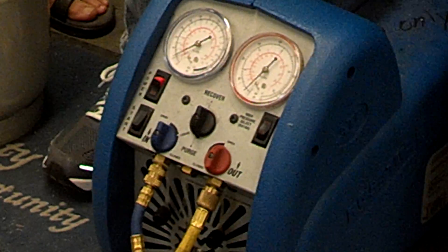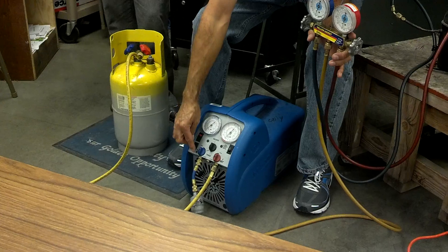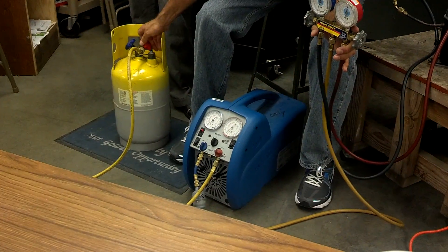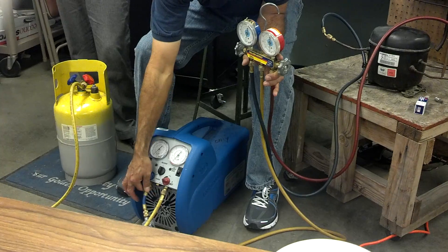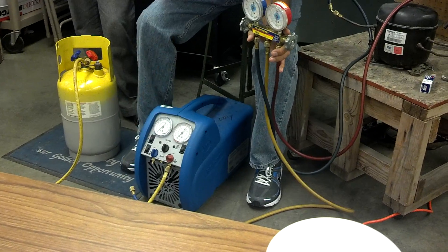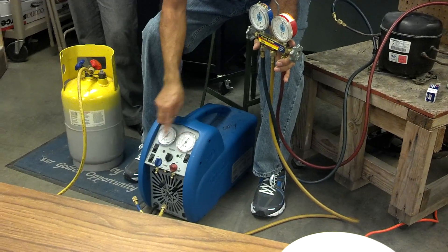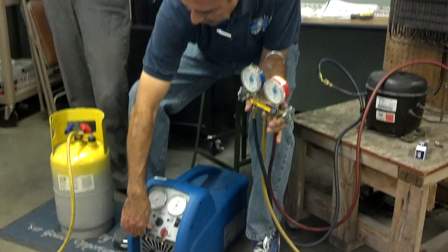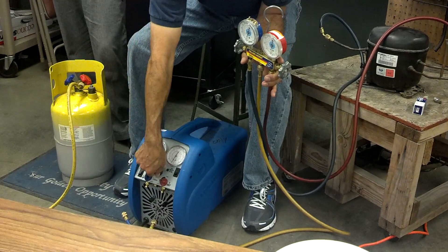Fire it up — and it goes down right away, all the way. Now start closing up: come over here and close this one, then this one, then you're done — turn this off. It's on purge, so when you open this up you should not have any pressure in the machine. A very small amount came out — you never want any air or pressure in this system. Both gauges need to be on zero or vacuum, meaning there's no pressure in there.